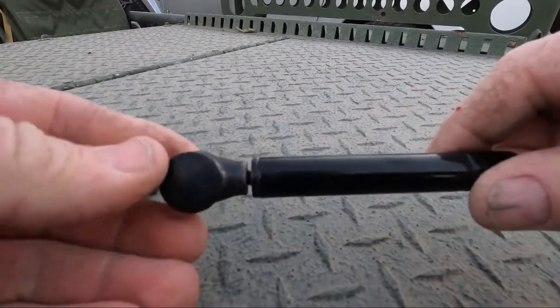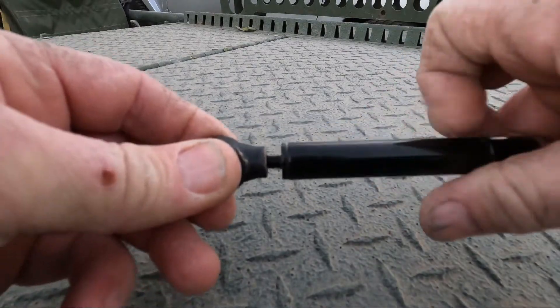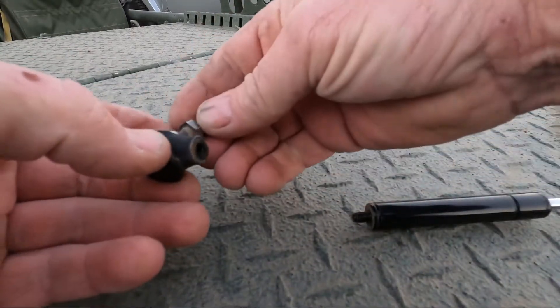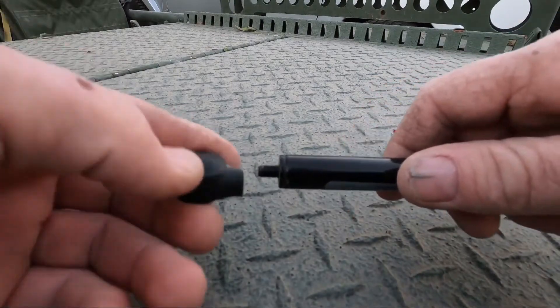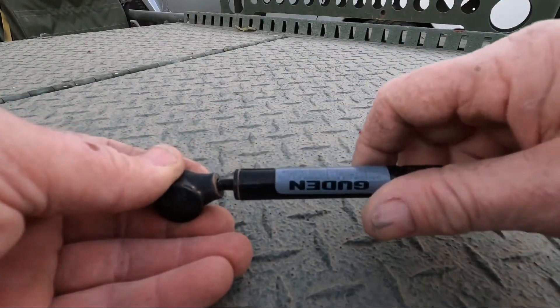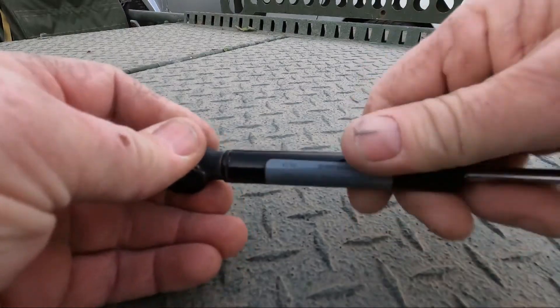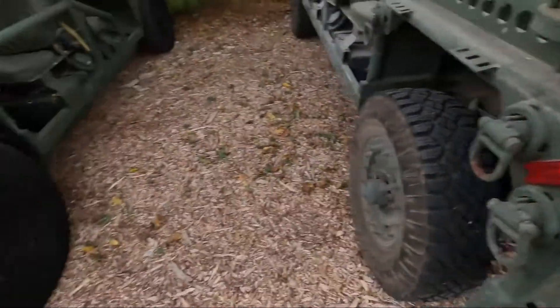What I do is get under there, pry that up with a screwdriver, and just pop it off. Once you pop off the trunnion ball end, you just grab the rod — the barrel of the ram — and unscrew it. So you basically unscrew it right off, leaving this side still on the trunnion ball. Then when you get your new ram, take the end off the new one, reach in — it's not too hard to reach in there to grab it — and get it started. Make sure you don't cross-thread it, make sure it spins easy, and screw it back on.